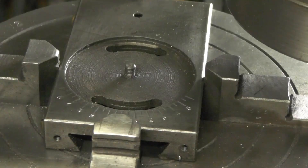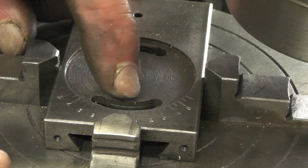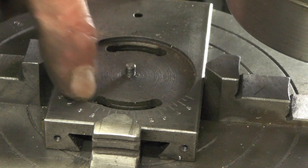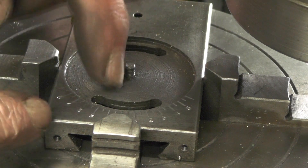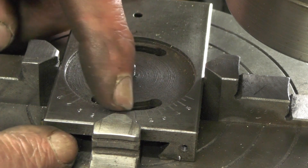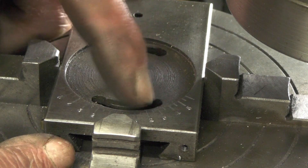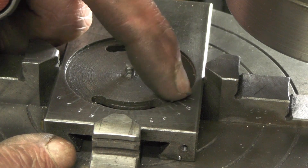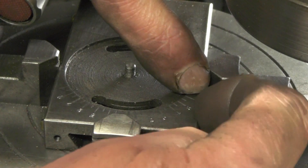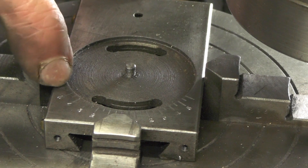Let's have a little bit of an update here. I've put the degrees in fives — if I'd put them in ones, it would have all blended into just one big groove because I'm limited for space. So I've done them in increments of 5 degrees. Instead of putting 0, 10, 20, 30, I've just put 0, 1, 2, 3, 4, so that represents everything with a nought on. I couldn't get number 6 on there to get 60 degrees because I've run out of material and I didn't want to stamp it and just get half a number 6 on, so I've left that blank.